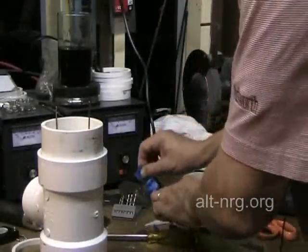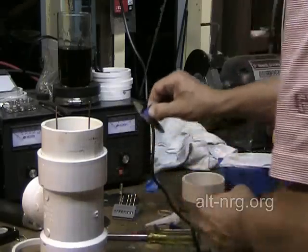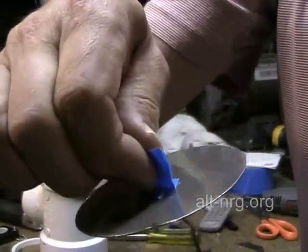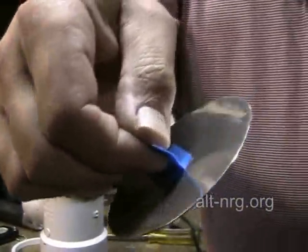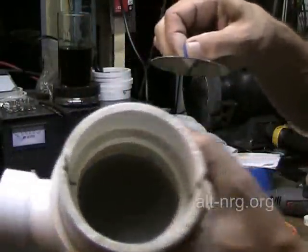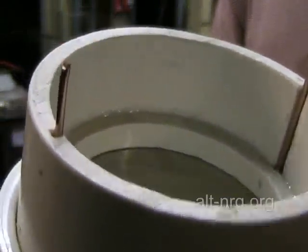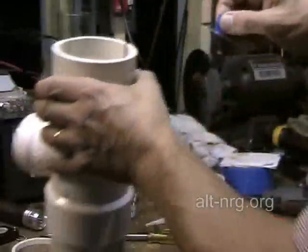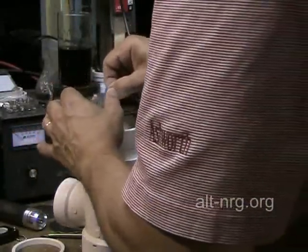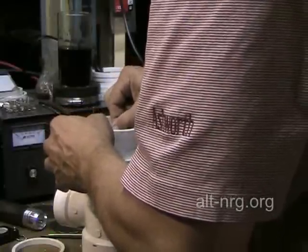Alright, I'm setting the fourth and final neutral plate on this one side of the cell. I've cleaned this one off with alcohol. I just wanted to show you this little trick I've got here. I take a piece of painter's tape and I just fold it into a small T so that I can pick up the plate without touching it and set it down into the adhesive that I've applied around the edge very thin. So thin that I'm not worried about it squeezing out into the channel that interconnects all of these chambers that are being created.